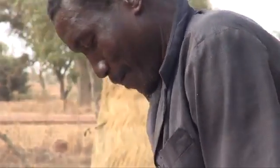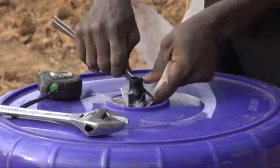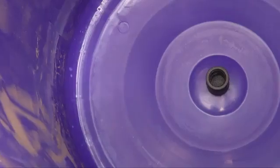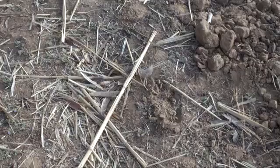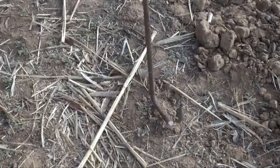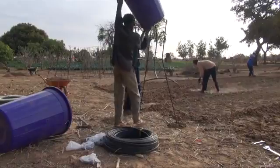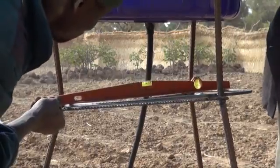Using readily available plastic buckets, a small hole is made in the bottom. A piece of screen is used to filter the water that goes from the reservoir into the pipe. At the site, ensure the support is properly leveled and that it is strong enough to hold the bucket, even with strong winds.